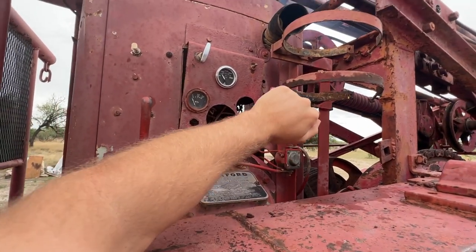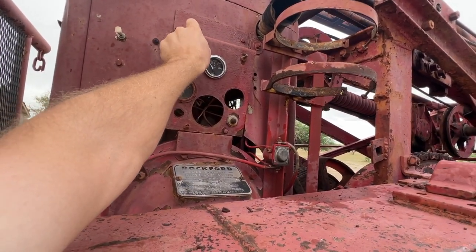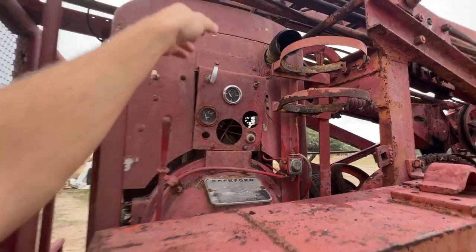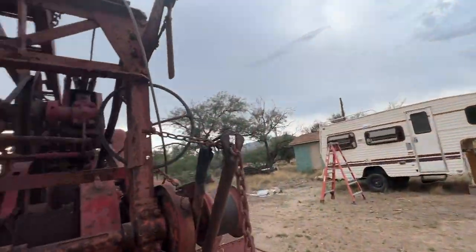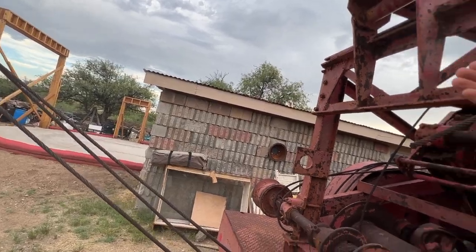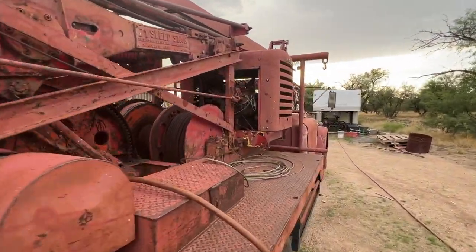For the majority of the buttons and knobs I think we could probably test them out, and most likely things will move slowly so you'll be able to say hey, that cable looks like it's stretching — let's go the other way. We should probably be okay. What was nice is that when we started it up, nothing was actually engaged — that was important. I did some research ahead of time on the clutch in front of the engine that actually engages the rest of it. I assumed the clutch was disengaged because it was loose, and that assumption was right. Round one to the guess!